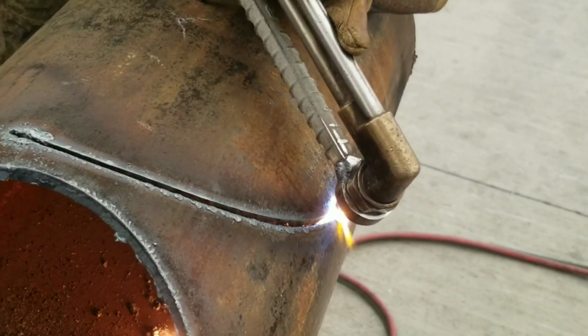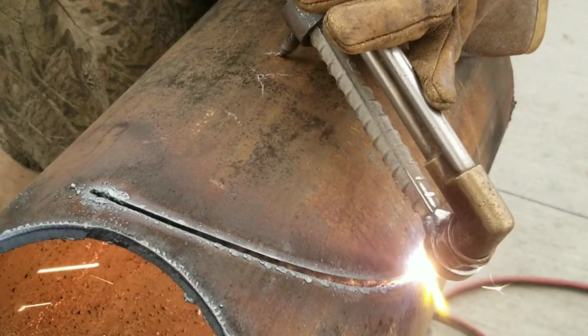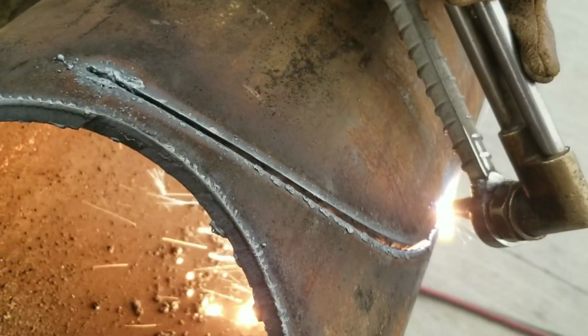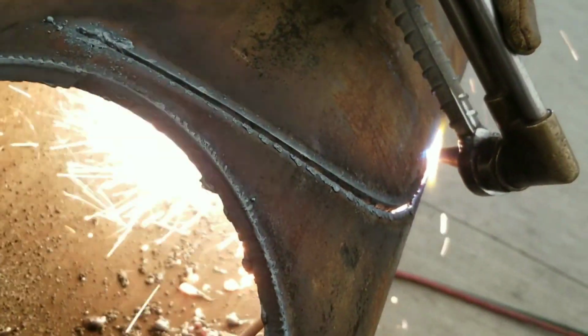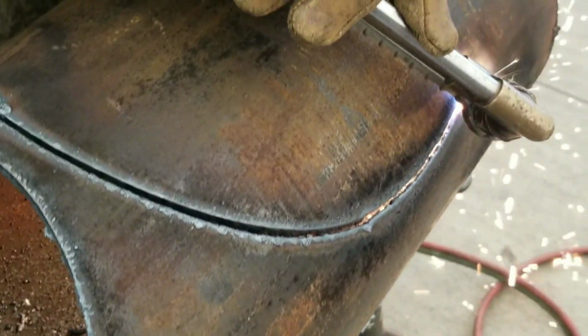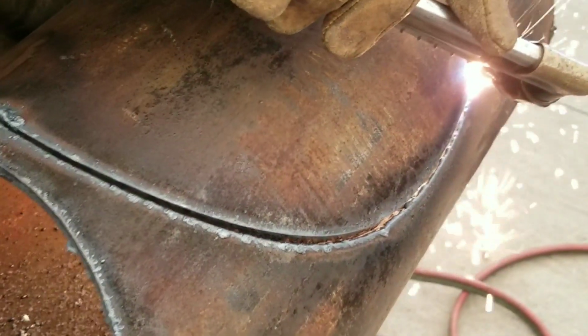One thing I forgot when I did this is you can see I got 2 holes punched up there. I accidentally had it off. So when you're doing this, make sure you're using the right center punch and cutting on the right one, because I did mess one up earlier today because of that other punch there, and I ended up cutting the inside hole in the wrong spot. So pay attention when you're doing stuff like this.